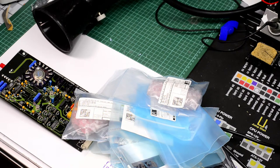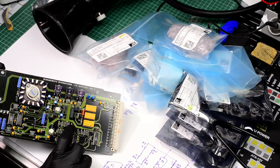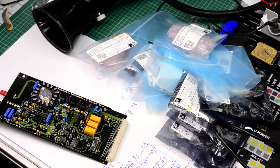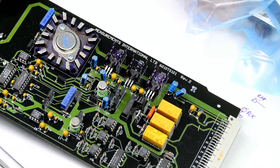So to test and troubleshoot the issues, other than reverse engineering the schematic piece, I didn't have a similar packaged foil resistor of 100 ohms, so I put in three resistors, 300 ohms each, in parallel, so I get a 100 ohm-ish value there. But just replacing the resistor, as expected, didn't help much, because something else was also broken. So that's that resistor network. You can see three resistors sticking out.